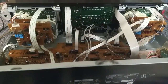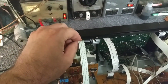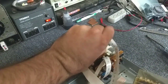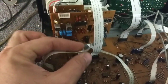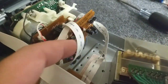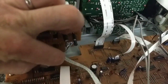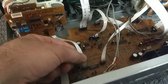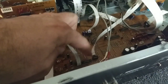The first thing you have to do in order to get these out is remove the front panel. On the WR820 we're working on today, it's going to have these logic cables. All the TCM 190s have logic cables that go to the front. You've also got power and signal going to the playback amplifiers, which just unplug here, and a cable to the motor board. The reason why I'm disconnecting them at the board here is because it's easier than disconnecting it after you take it apart.